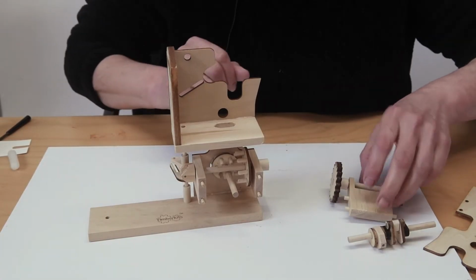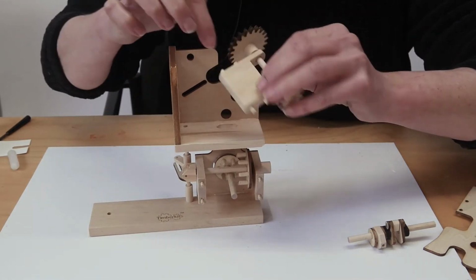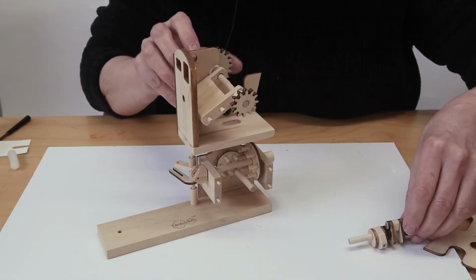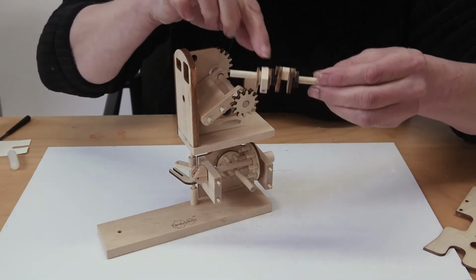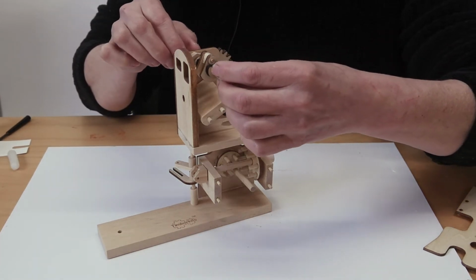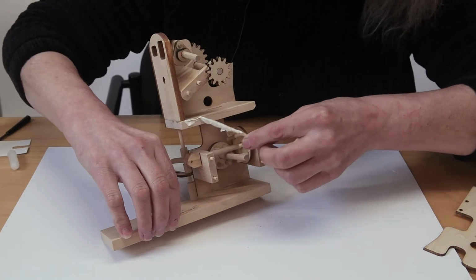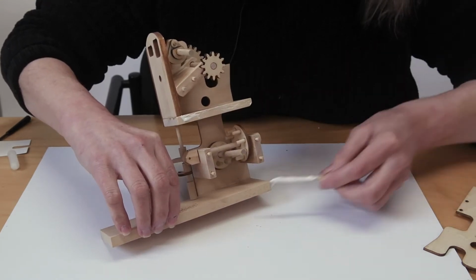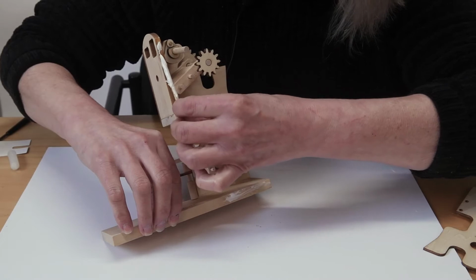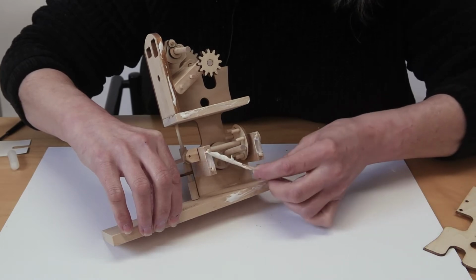Moving on to section 25, you've built this assembly. Just put it in by threading the cog on the outside and these two little pegs through that slot, and hold it in place. And this assembly that you've just made in 24, the piece with the spinning part goes first. Just slide that in with no glue. Then put glue along here, just along here, carefully down that side, and on these two surfaces here.